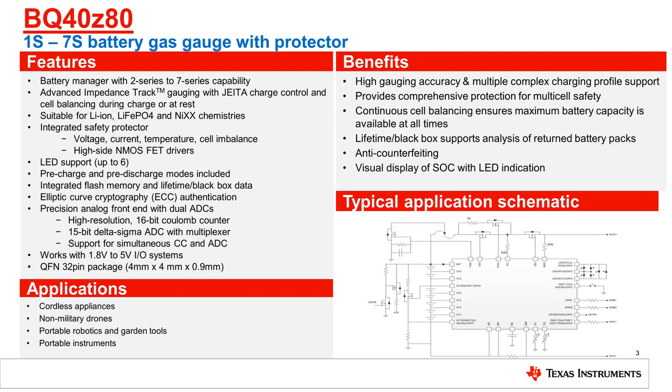The device has integrated programmable safety protections for overvoltage, undervoltage, overcurrent, short circuit current, overload, and over temperature. It can enable and disable charge and discharge FETs, pre-charge and pre-discharge FETs, perform internal or external cell balancing, and even perform permanent fail fuse blows if needed — all this in a small 32-pin, 4mm by 4mm thin QFN package.